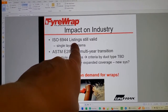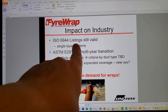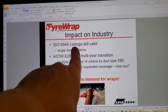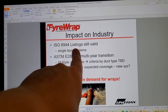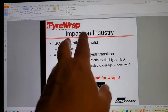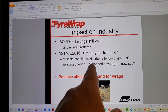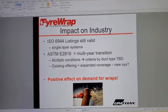If the intent of the code is shaft walls, which require compliance with ASTM E119, meaning that you are the equal of the conditions of acceptance for non-load bearing walls: fire can't get through, the heat can't get through, the hose stream can't get through, and you don't get to separate out the fire stop and just beat up on the fire stop in terms of the hose stream and the thermal requirements, and then the rest of it is okay with minimal protection.